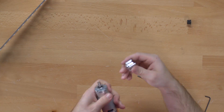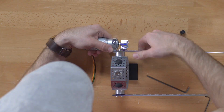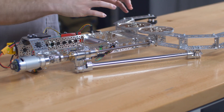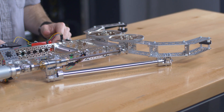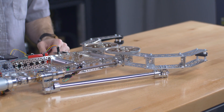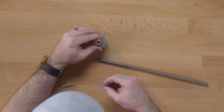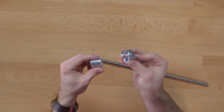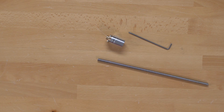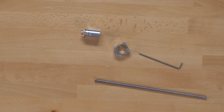If it was for practicality, you'd probably want two — one on each side — but I kind of liked the aesthetic of having the asymmetric setup of having the linear actuator running on one side, and the giant gears, which I've been dying to use, mating with each other to open and close it. The assembly that I have traveling up and down the lead screw is a little bit heavier duty than I really need; I wanted to show a setup like this in case you did need more stability or more strength as you're running something up and down your lead screw.